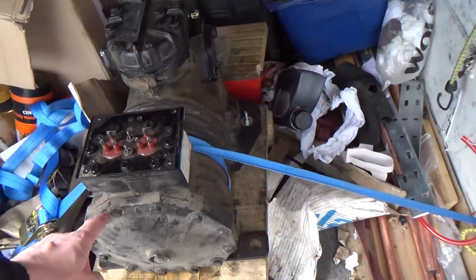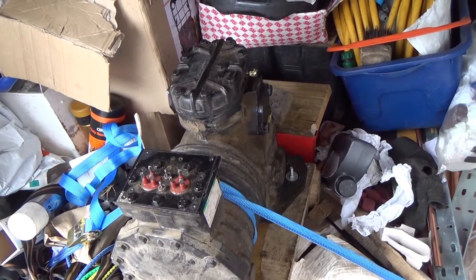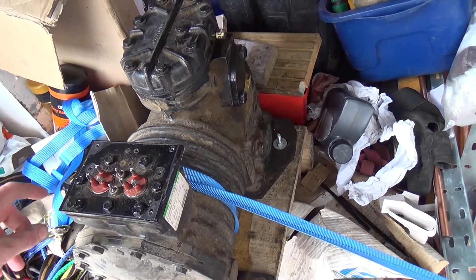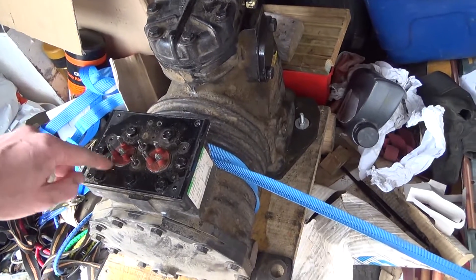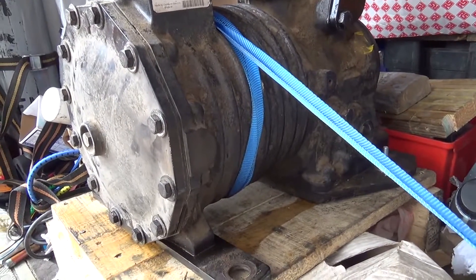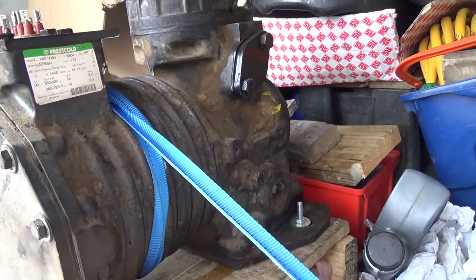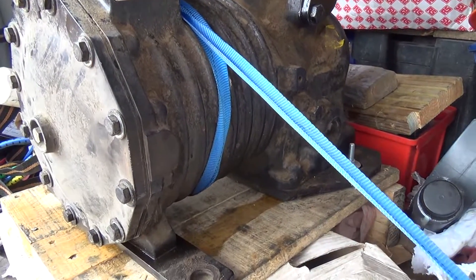But if we found no oil in there and a broken rod, then we might be looking at liquid coming back and washing the oil out, or undercharged even. Poor oil return because there's not enough suction velocity to bring the oil back — things like that. Otherwise you could end up having the new compressor fail. And all they'll do is strip it down and say it's failed because something's wrong with the system, and you won't have a warranty. It's only on faulty manufacture — it's not like an insurance policy or anything.